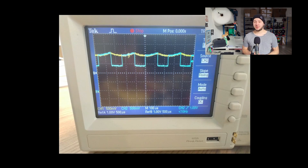The interesting part about the picture is the blue line. What should have been a consistent, stable 2V was instead going back and forth between 2V and 0V over and over again, at a very specific frequency of 12 kHz, which is hearable by the human ear. So there was a component on this circuit vibrating at 12 kHz and generating noise.